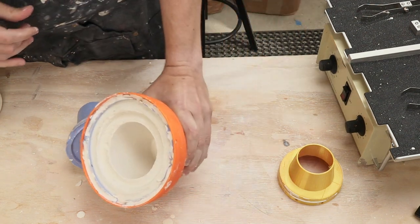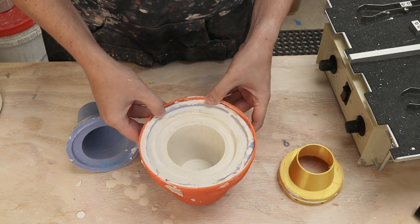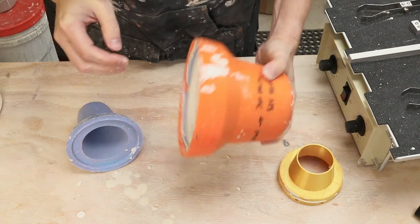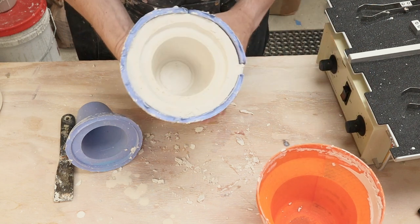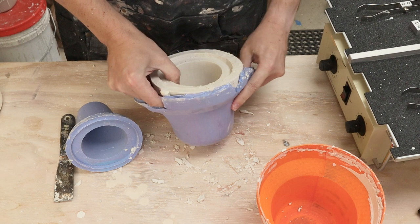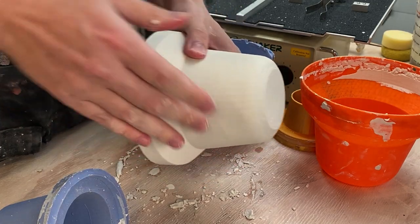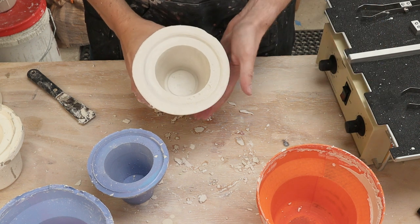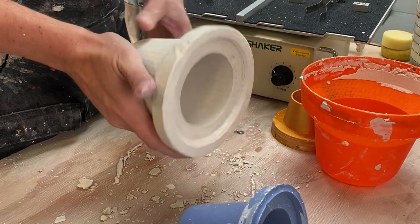And this is the one that really matters. That is not exactly what I was expecting — there's clearly a bunch of bubbles at the top surface and unfortunately I see some down the bottom too. The plaster got down on the back side of my mold. With the magic of silicone, this will just peel off. The outside looks much, much better — compared to my other molds there's a huge difference: it's very smooth while the old one is very bubbly. Definitely something worked. I really like my new orbital shaker — it seems to have done a good job moving bubbles up through the plaster. The Windex seemed to work as well, and I really like the new mixer since it wasn't sucking bubbles down into the plaster.